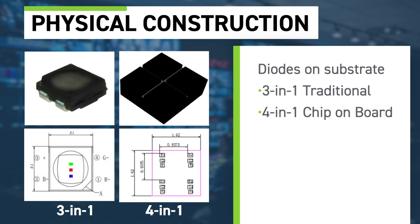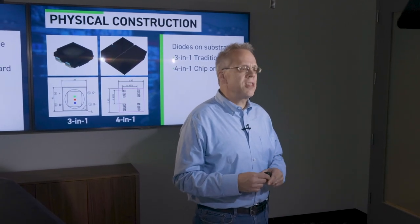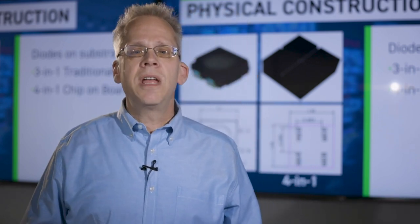A newer type is called four-in-one, or chip on board. This takes four packages and puts them into a single larger package, allowing manufacturers to get down into fine pitch — everything below two millimeters, from 1.9 down to 0.9, is typically done in four-in-one. It's easier for machines to assemble, and the chips can be covered in an epoxy resin, making them much more durable. This also prevents the issue of LEDs getting dented, damaged, or picked off their substrate during the assembly process, which is common with fine pitch LEDs below two millimeters.